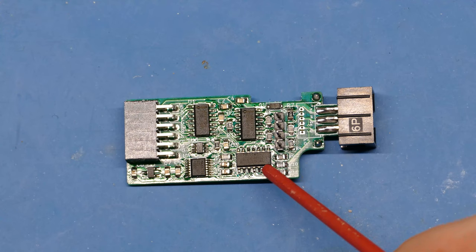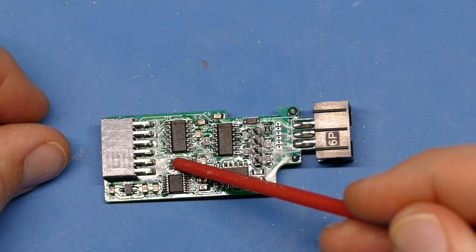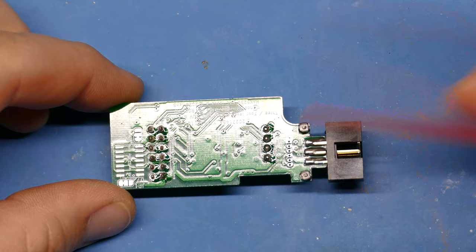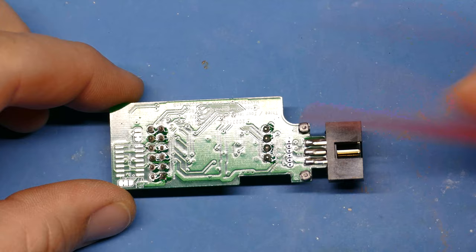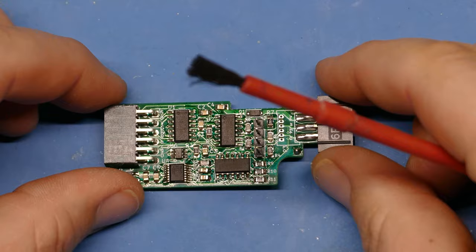Other than those major chips, the board has resistors, capacitors, a small switch, and a 3.3 volt voltage regulator. There's also room for expansion on the back — you can add another comparator for certain systems. So let's take a quick look at the schematic to see exactly how this thing is working, and then we'll try to program it.